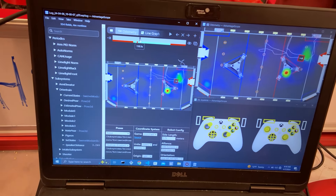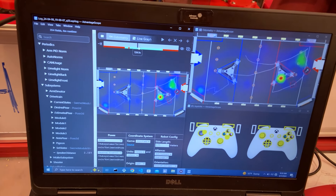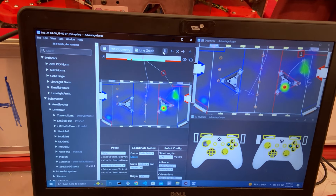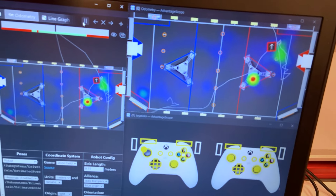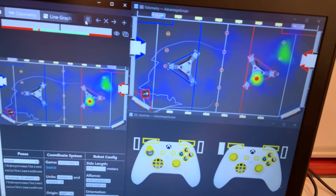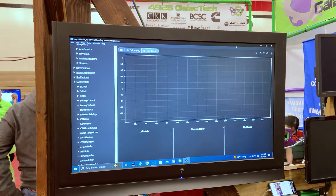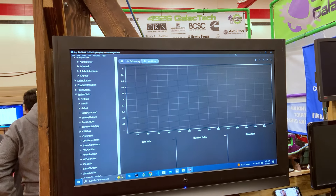Danny, there's a lot of work on the programming side for logs, tracking logs, and a lot of automation. Can you go into a little more detail on that? Yeah, I can. One of the things that we use the logs for the most is battery voltage. We use this so that we can look at batteries and determine whether or not they're actually a good battery. If we notice that it's much lower than other batteries, or even that it's running out much earlier, we'll take it out of circulation — especially at a competition, especially during ELIMS.